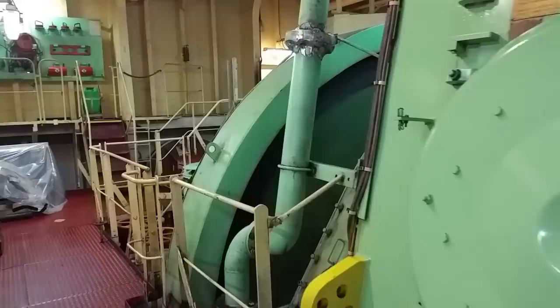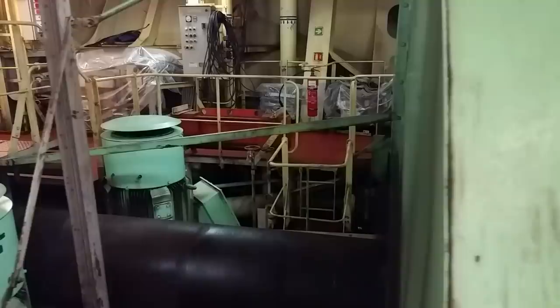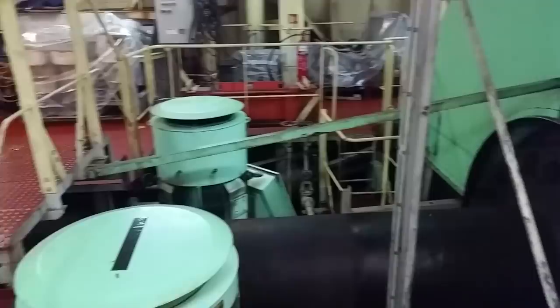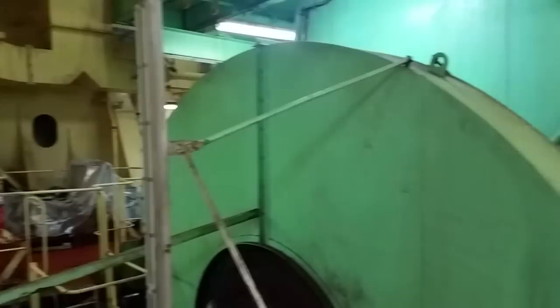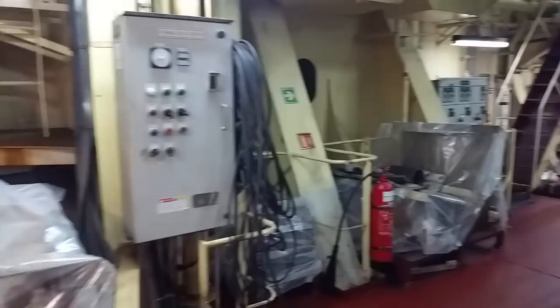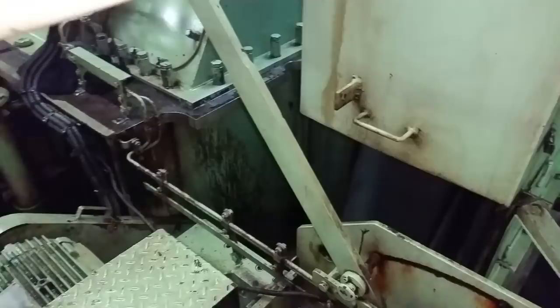This is the large planetary gear. We have two big lube oil pumps here — we saw the spare one upstairs. These are the main engine lube oil pumps. On the other side of that planetary gear there's a jacking gear — it's a smaller gear that engages onto this large planetary gear. There's a controller just across here with a push button, and you can manually turn the engine when you're inside doing an inspection. That motor with the handle engages the small gear onto the large planetary gear so you can control the engine rotation during maintenance.